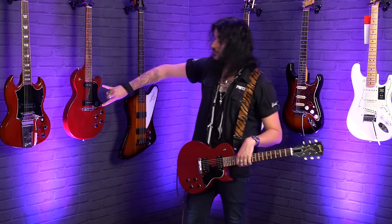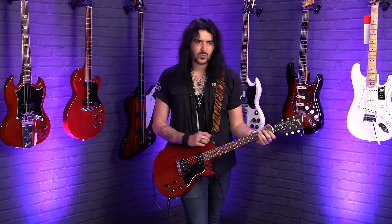And they're called humbuckers because they buck the hum — because there are two coils in each pickup. It's literally as simple as having both pickups on in a P90 setup, or positions two and four on a Strat to get rid of the hum. They've wound two single coils together to get rid of the hum and give you a really loud, warm, beautiful tone that we associate with so many iconic riffs.